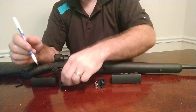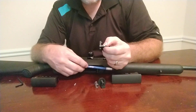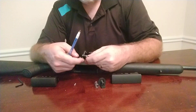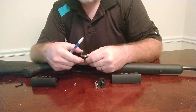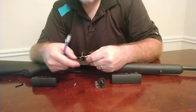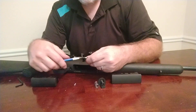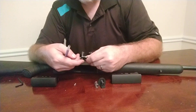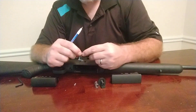This was the Gen 1 part. What I was trying to do, like a Model 10, was just not break the line of the stock and the magazine with the length of the handle. In retrospect, I don't necessarily know if that was that important to people. But because this is a retrofit product with a limited handle length, and the pin is located so close to one end, we have a limit to how much force we can easily actuate, which limited the spring force being used.